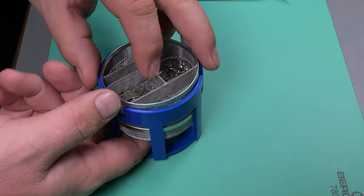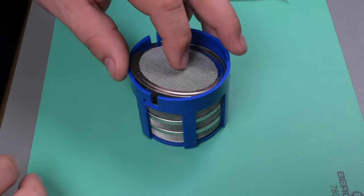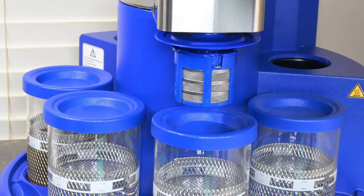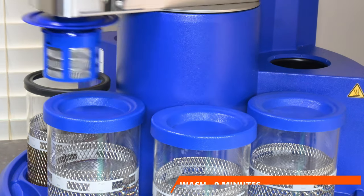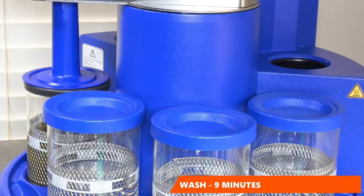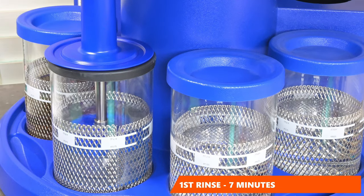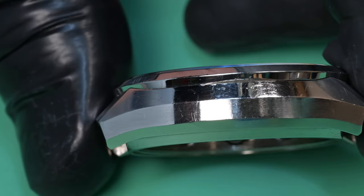Here are all the parts laid out — aside from the screws, which I have cataloged according to their spot. I clean the screws in rodico if they're really filthy. I don't run them through the cleaners in a basket like I see some other folks do — I don't like having to re-figure out what screw goes to which position. After loading everything up, here's me putting it in the cleaning machine — it goes through one wash cycle and the rinse cycles run five minutes each, followed by the dry cycle.